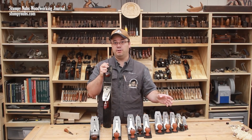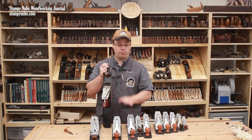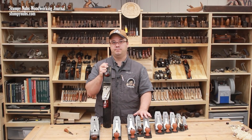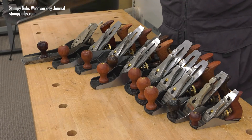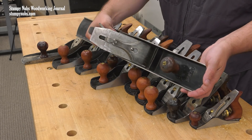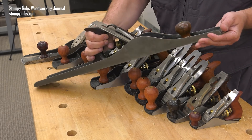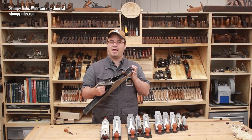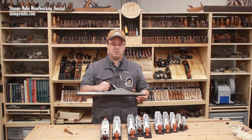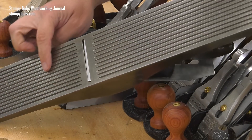The number 7 is the first true jointer in the lineup. If you have trouble getting perfect seams on your panel glue-ups and you have access to a number 7, this plane can clean up the machine marks made by your table saw or power jointer with just a pass or two. And if you don't have a power jointer, a number 7 may be used to flatten the surface of a board after some prep work with your jack plane. Less common than the number 7 is the number 8 jointer — the largest plane in the lineup. Mine was a gift from a viewer and I'm glad for it because it helped me fill out my set. But I admit I almost never use it because it's just too much plane for most jobs. You'll note that this one has a corrugated sole.